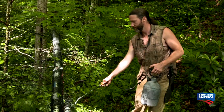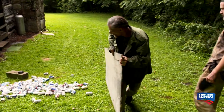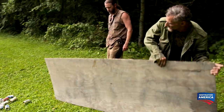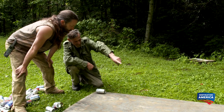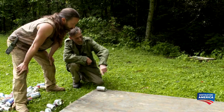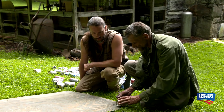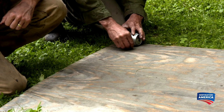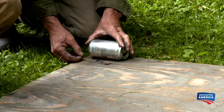Got this piece of plywood here. The boys are using beer cans to build a solar water heater so Eugene can get himself a hot shower. These rows of cans are going to have switchbacks — water will come in on that end, travel down this tube, and switch back all the way back and forth. We got to make sure we have a small space in between each one. It's real important to keep a real small gap, as that acts as an insulator so the cold water can't draw heat away from the warmer water going through the system. We got enough room for 12 rows of cans.